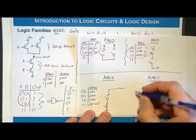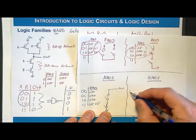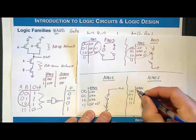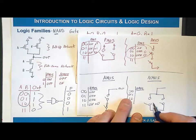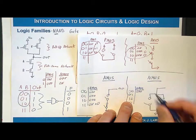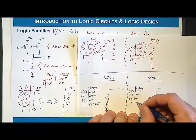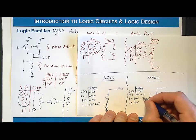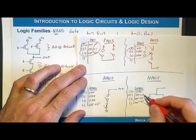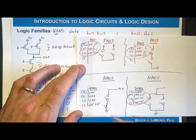And then in a similar manner, if you come over here and I looked at all the possible codes I could have, I would have 0001 1011, and I want to know what the NMOS does. Well, for this situation, I'm going to have 0 and 0, they're both going to be off. But then, as soon as I have a 1 on any of these, I'm going to have an on, and an on, and that's going to drive a 0, 0, and a 0. So notice again that this configuration for these three codes does not match an AND gate. Neither does this one right here.